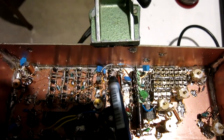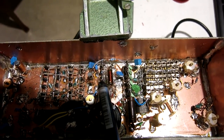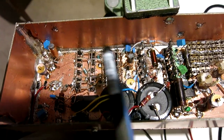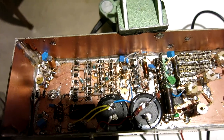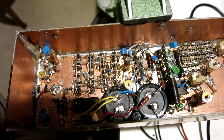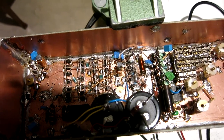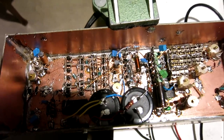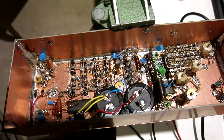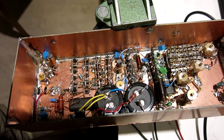After the crystals there is an amplifier with bootstrap circuitry, and then a power amplifier with many parallel JFETs that can deliver about two and a half watts. The whole thing takes 700 milliamps at 25 volts and gets fairly hot. I have to put coolers on it later to reduce the thermal noise from it.